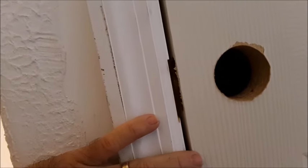Now that we've gotten the side with the hinges installed permanently, this side needs to be adjusted to the right width to allow proper clearance of the door when it closes. The doorknob side of your frame enclosure has the ability to slide up and down. We'll install a screw in the top part so we can adjust exactly where our clearance needs to be on the top of the door. As I turn the screw it'll adjust the height of the door clearance so I can get the top clearance correct across the top of my door. If I need to drop it down, I just turn the screw back out the other direction.